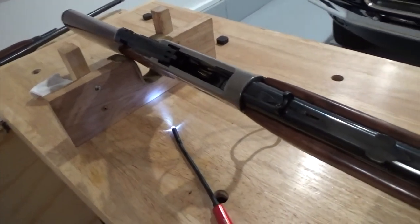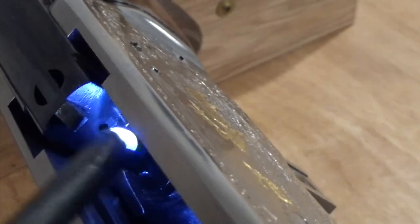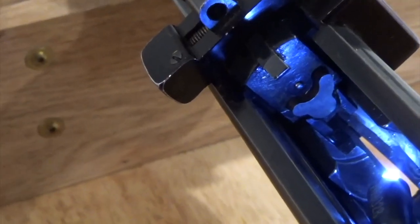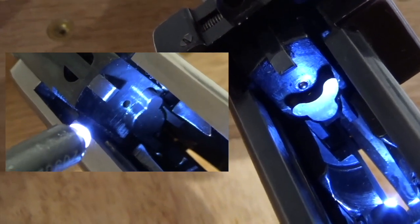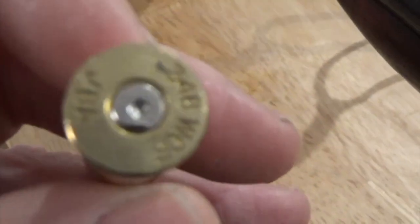Here's an original Model 71 made in 1946, and on the rack there we have the Browning Model 71 made in 1985. The ejector on the Browning seems to intersect very closely with the firing pin hole. Take a look at the original Winchester — you can see how far away the ejector is. On that design, which I would say is a better design, the end result is that your primers are going to be engraved with a line. It doesn't seem to cause any problem, but it does take a mark off, in my opinion, for the Browning design.